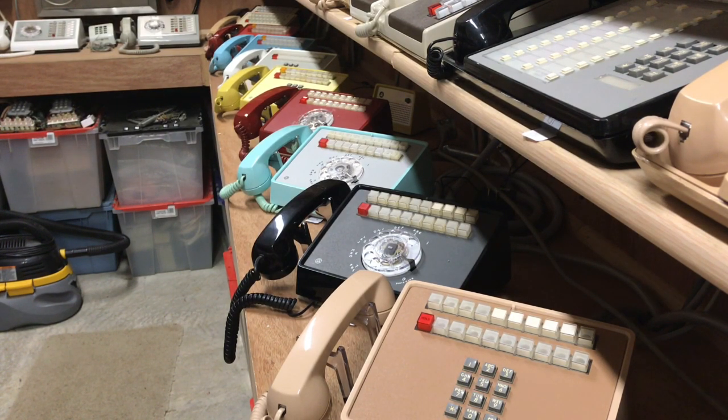I've only seen three-link intercoms ever in use in the Com Key series telephone systems, and I do have a 718 Com Key that has the two-link card. The three-link card that I have is acting flaky. This system was incredibly difficult to make work. The 626 panel that I started with was damaged and has a flexible backplane circuit board, and the plastics had dried out and the connectors started to not stay where they needed to, so when you plugged in a card it may not be completely seated into that socket, as well as issues with traces on the flexible circuit board.